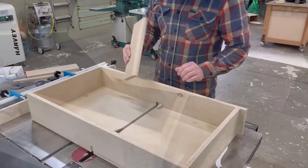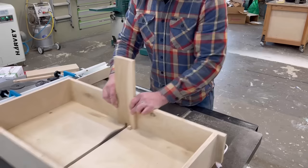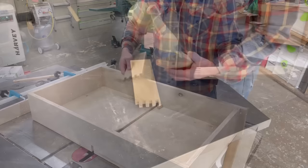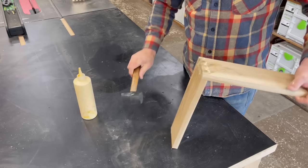After the dowel pins, I made a box joint. For this I'm using my homemade box joint jig — and yes, I have a video showing you how to make this exact jig. It's super easy and you can definitely do it on your table saw at home. You basically just run all your pieces through the jig, cutting your box joints and making sure they match up and are spaced evenly. Once you get all your pieces cut, you just smear some glue in between each one of your box joints using your patented glue spreader. Then using a rubber mallet, you just bang all the fingers together and make sure they're nice and tight. I normally don't even put clamps on this one because if it's a tight fit, you just don't need them. After the glue dries I sand the whole thing down, and it does look pretty. I've always had a soft spot for box joints.